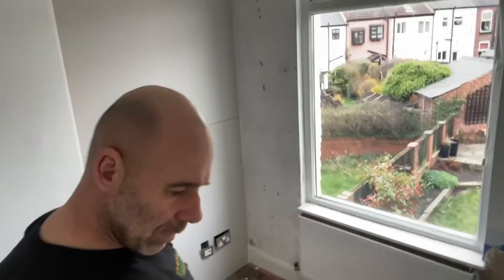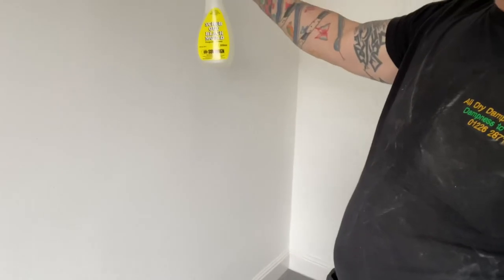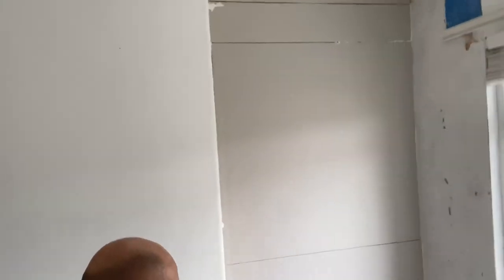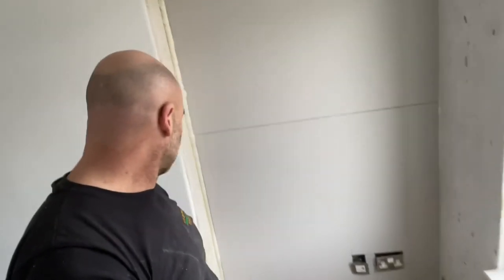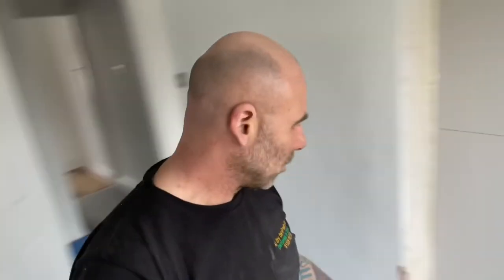Tomorrow we'll fetch the beads and get it beaded up and skimmed. There's this wall as well - there was a bit of mould on things so I treated it with Sovereign's mould treatment, all the way to the top. You can get longer screws for plug sockets. That'll be sliced off, scrimmed up, and then skimmed - warm the wall for her. That's going to have to have a Showa-Therm anti-condensation paint on it, but here is the worst area for condensation.